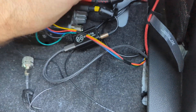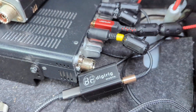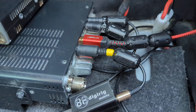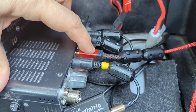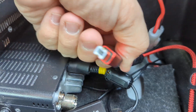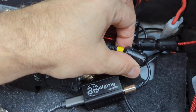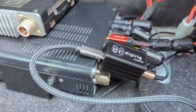So the connectivity — there is an accessory port here and an accessory port here, and then this is the USB port. The FT-891 utilizes the USB port to switch bands and get the frequency and CAT readout, so this is basically your CAT port. You need a USB-A cable, and I have that running all the way to my front seat. That's one connection I have — a USB connection to my laptop. The second connection I have to my laptop is the DigiRig, which has USB-C, also running to the front. So I have two USB connections into my laptop in the front seat.